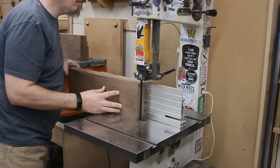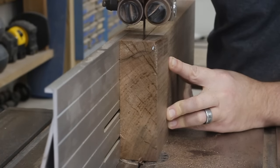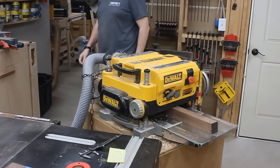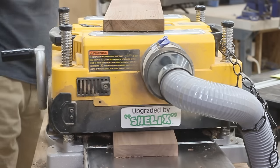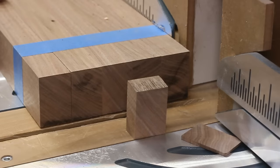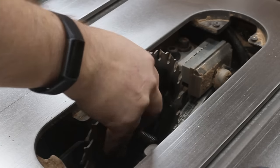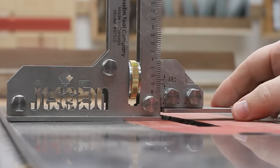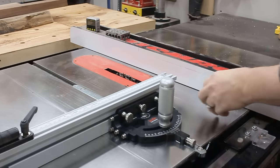Next was getting the pieces to their final thickness. Instead of running them through the planer a zillion times, I used the bandsaw to re-saw off the majority of the material. Then over at the planer, I smoothed out all the bandsaw marks and brought each piece down to its desired thickness. For the pieces that all needed to be the same length, I just bundled them together and cut them all at once. Now it's time to start cutting the tenons in the uprights and the sides using a dado stack. You don't have to have a dado set to do this, but it sure speeds up the process. I get it dialed in to the exact right height, and then I use my miter gauge and a stop block to cut the pieces.